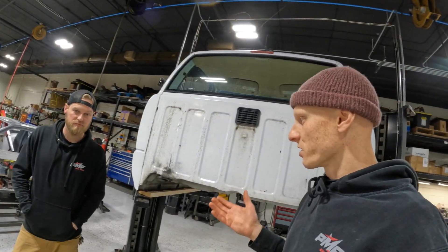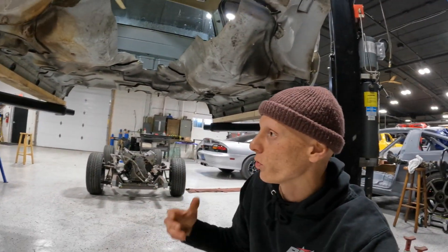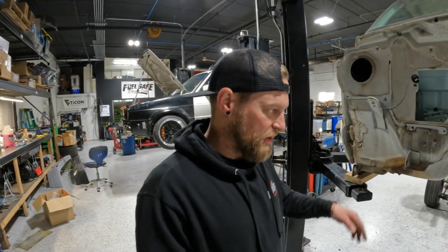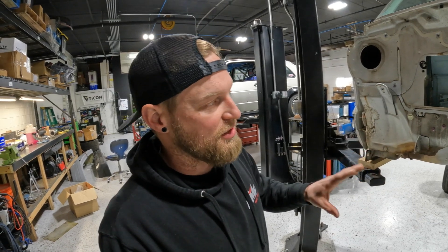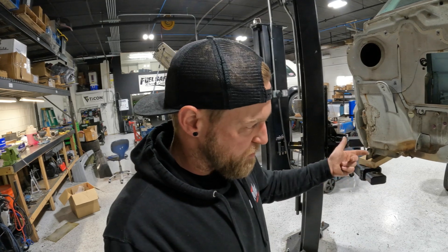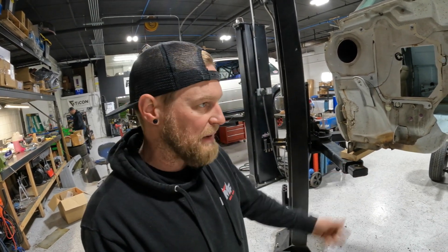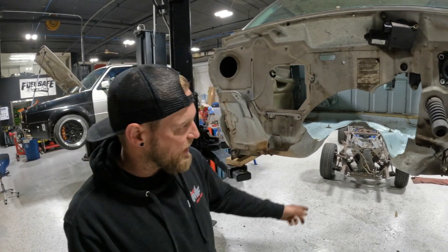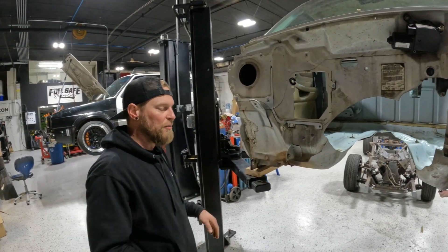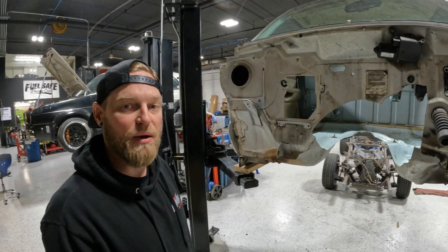You mentioned the firewall, and I think that's the next big step. DJ was cutting into this and the cab is ready to start getting the chassis put on. What are the next steps? A little more cutting and trimming. One thing we did on the chassis is we designed the transmission mount to allow the motor to be moved forward and back. After some initial cutting being more intrusive into the cab than we wanted, we're going to flip the motor mounts and move the motor slightly forward in the chassis, then come back and revisit the firewall. Tunnel, drive shaft — as soon as you stuff a motor that high up, especially that motor, you can't fit it into something intended for a considerably lower motor position. So we'll cut for the drive shaft, start to put it all back together, make a nice tunnel, and probably leave a bell housing access point so they can get to the bell housing bolts by pulling an access panel from inside — making it a little easier to service.